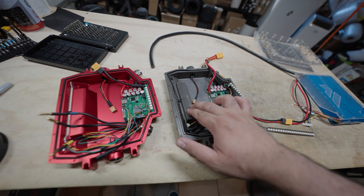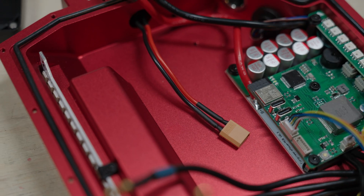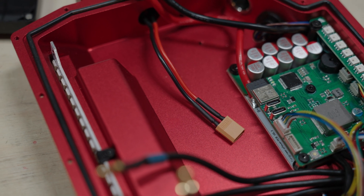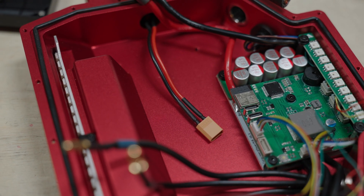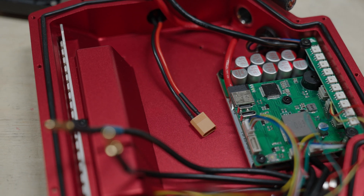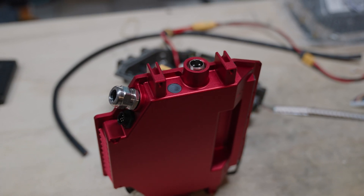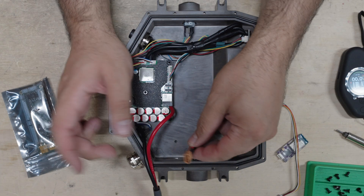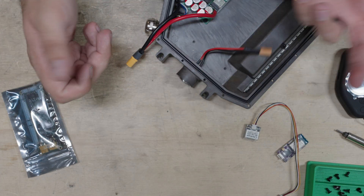Starting at the VESC itself, I really do appreciate the Thor 300. It had a pretty rocky start, but for the most part it has reached a pretty stable place, and it remains one of the coolest running VESCs that you can get, especially when paired with the aluminum front enclosure box. The complete box set is convenient and has most of the connectors in place already. I did change one thing — specifically adding a fuse to the charge port like I usually do.